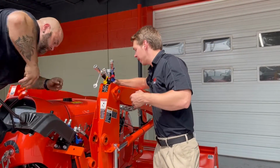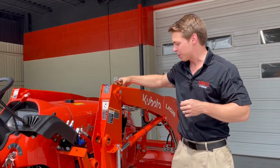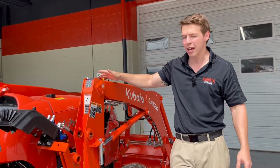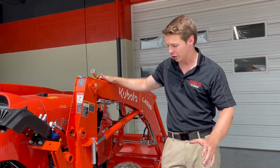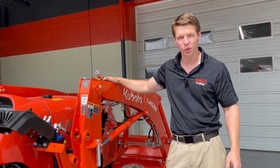On these, they're going to sit there. They're going to sit in your loader kind of stay area here. They're going to drip some hydraulic fluid on the ground in the tractor. That's fine. That's normal. That's what it's designed for, these Pioneer couplers. And now you're good to go. You're disconnected from the tractor. You're no longer hooked up to the frame. You back out, and you no longer have a loader on it.